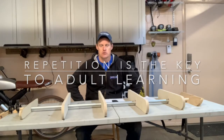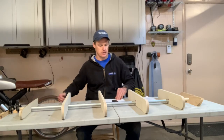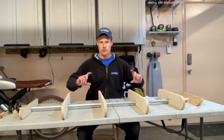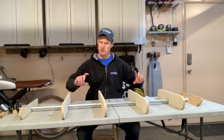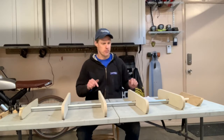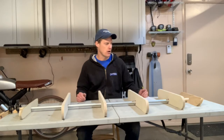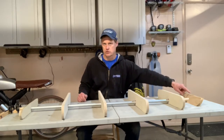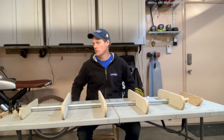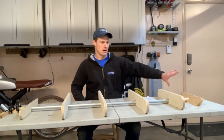With the form built, let me explain it a bit. This is a five-and-a-half-foot design similar to the cruiser version of the Lift board. The internal dimensions are three and three-quarter inches deep, giving about 95 millimeters of internal depth. The widest portion is 28 inches. The forms are made from three-quarter-inch sanded plywood — one two-by-four-foot section was more than enough. The rear transom and the nose piece are made from cedar and will be left in the board permanently: the nose will have cedar strips wrapping around it, and the transom will be the visible exterior at the back.